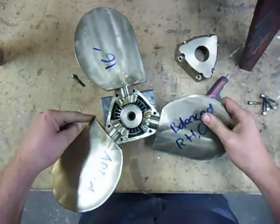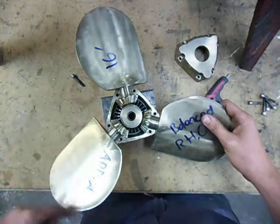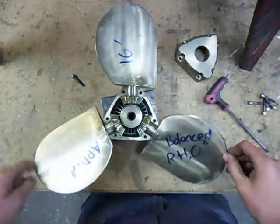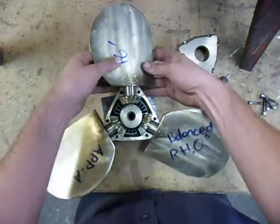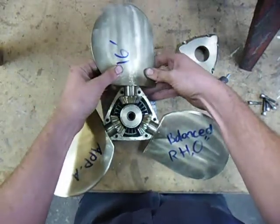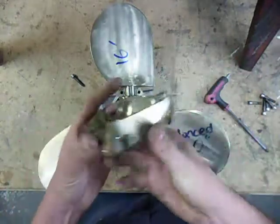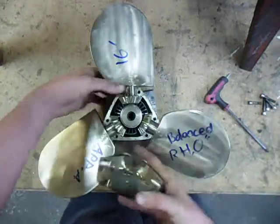The key thing is, if your R and dot have been ground off, the straight edge is the leading edge of the prop and the round edge is the trailing edge. In this datum position, it shouldn't be flat — it should be one tooth over into a pitched position. There's also a datum on the side of the body, two halves.